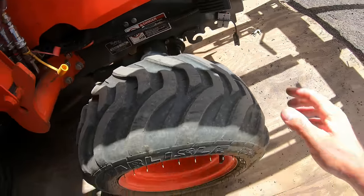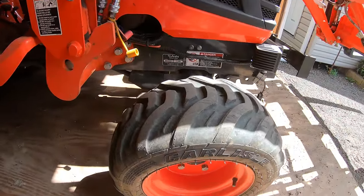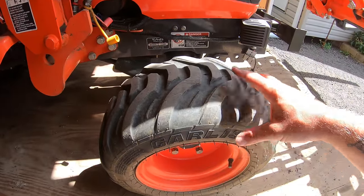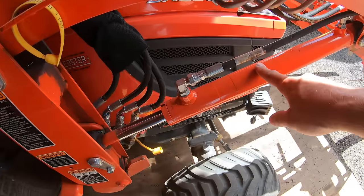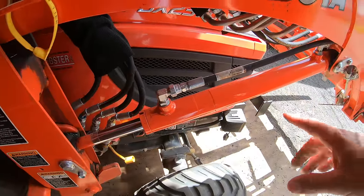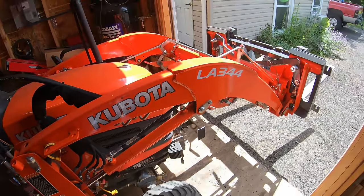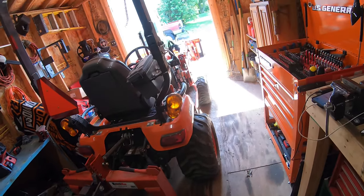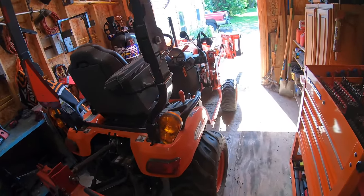I think if I can get around that and keep enough air pressure in my tires, I should be able to go a little bit higher on the pressure. I don't want to go over like 2,400 PSI, and I probably won't ever increase it again because you're really reaching the end of the limitations of this tractor — between the tire size, the rim size, what the tires can handle, what the front axle can handle, what the steering can handle, and even what the cylinders can handle. These are only rated probably 3,000 PSI, same with the hoses. Once you start creeping up there at 2,500 PSI and putting loads on these, that pressure gets increased even more and you're really going to be apt to blowing out a cylinder or bending a rod. This is definitely dangerous — I don't recommend it at all. I'm just doing it because I like to push the envelope and find out where this thing breaks, and if anyone's going to break it I'd rather have it be me on footage showing what bent or broke and at what pressure.